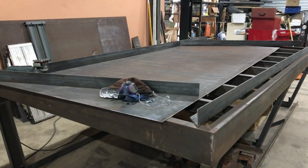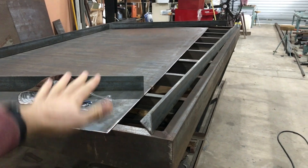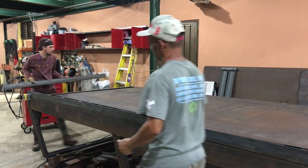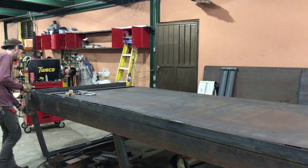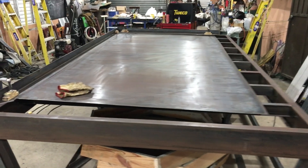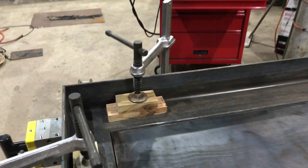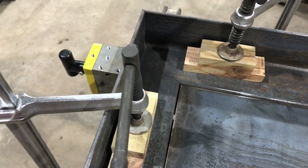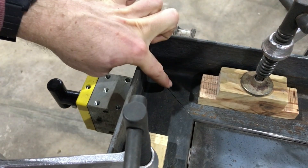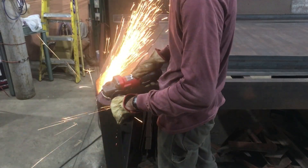Since I know the table's square, I'll position this angle iron against the edge and the other one there, then bring the sheet into it nicely, make sure everything is good, and get everything clamped. Right here is the basic idea — just getting the plate pushed up nicely, seeing how well it all joins together, with a little more adjustment needed. I probably want to grind some bevels into the angle iron ahead of time so that it can get a stronger weld.